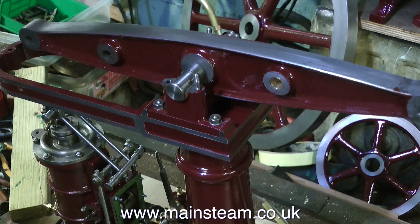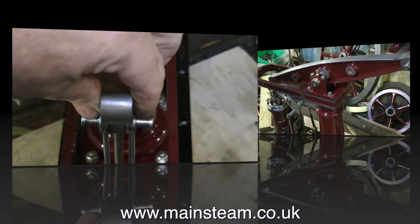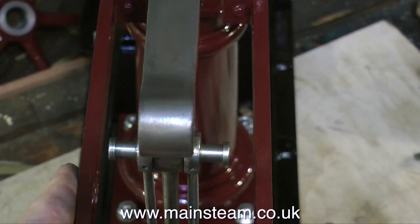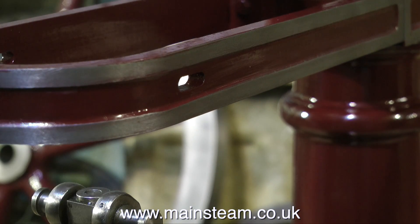After oiling the bearings and oiling the top of the cross shaft, I can fit the top caps and check the position of the main beam relative to the cylinder. Don't forget the column is still loose, so it will allow me some adjustment as you can see here. The camera angle is not quite good here, I must admit that, and I do apologize — it looks like the parallel motion cross shaft is miles out, but in reality it isn't.